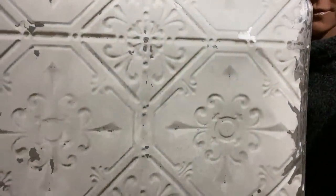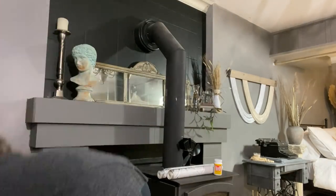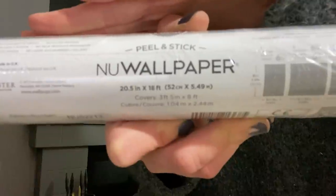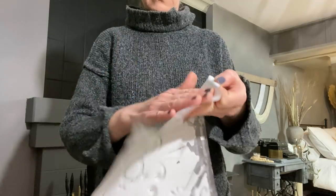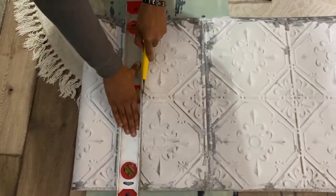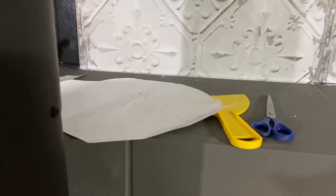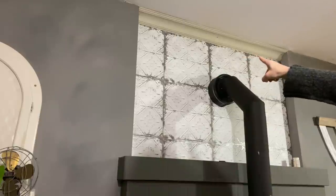This will be part one of three things I'm doing with this fireplace, which is a little bland and too dark. I originally painted it because all the tile work was probably from the early 80s, so I went with simple black and gray. But now I'm changing things up and decided to use this peel and stick wallpaper. What I really love is the design looks so three-dimensional and it's really easy to apply — just a ruler, a pencil, an exacto knife, and something flat to smooth it down. Depending on where you want to put the wallpaper, measure it out and cut it into small sections. Cutting around the fireplace pipe was a little tricky, but with some math and the exacto knife I pulled it off. This is so much easier than using wallpaper paste — great for a little area you just want to refresh.